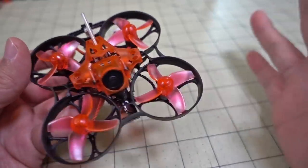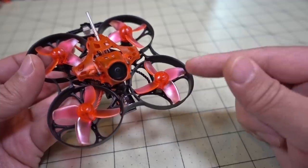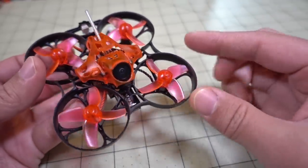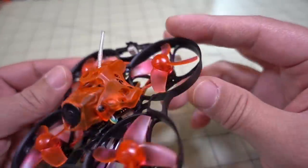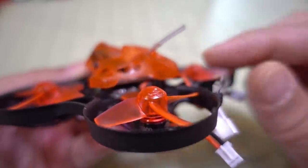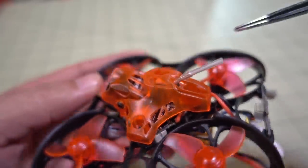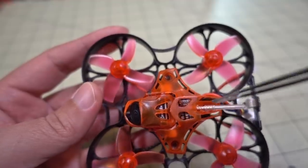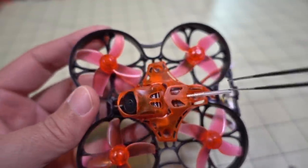In terms of the overall speed, I thought they were fairly comparable. The Mobula 7 has a little bit weaker motor, but it's also lighter, and I'll show you the weight differences as well. This is heavier. This has got bigger motors and better camera setup here with a separate video transmitter. So obviously, where we talked about the camera, it's got a separate video transmitter board, and it's right there. It's a triangle shape like this, and it has a little whip antenna here on a micro FL connector, so you could possibly switch that out for a cloverleaf if you wanted to.